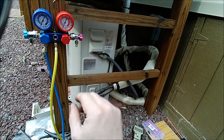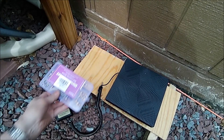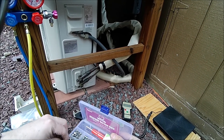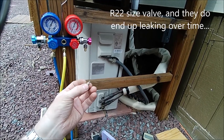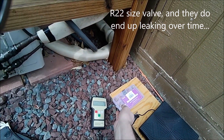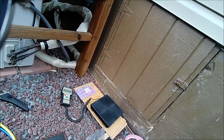This unit is working now — I had actually done a recharge on it and it worked great for another few months. But the problem is these little seals in here, these little valves. I'll show you this kit, but it's this valve right here — this little ring on the bottom goes bad on these. So we're going to bring this down to a vacuum and then recharge the unit up to 63 and a half ounces using the scale and that tank.